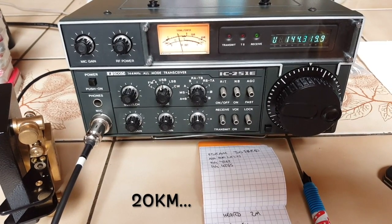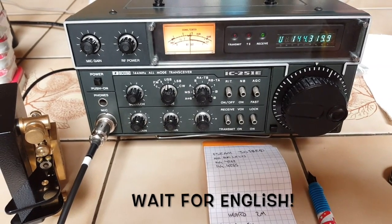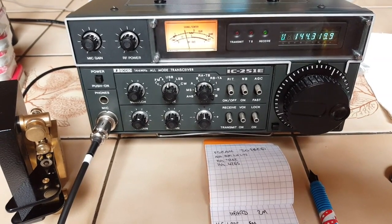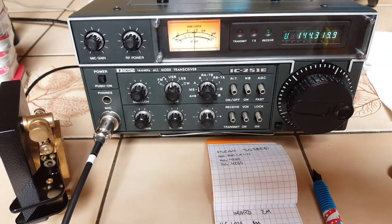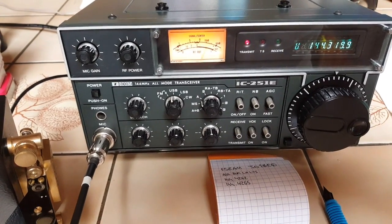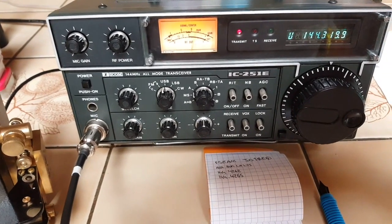Let's have a look at what I did — a couple of contacts with England and one with France. I'm listening to all the bands at the same time. There are some stations: N4MF which is very active, F0FIG, and F4Z9 which is the station of the lighthouse at Dunkirk. I wasn't sure of the call frequency — I found on the internet, on Wikipedia, that it was 144.300. In CW I call on 144.050, and I also tried on 144.060. I would like to try contacting England because I speak English.